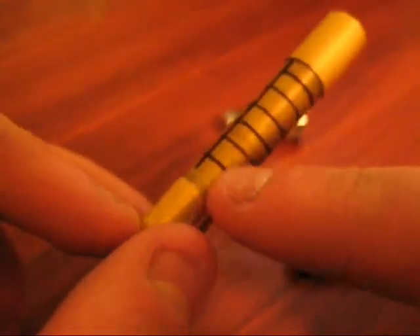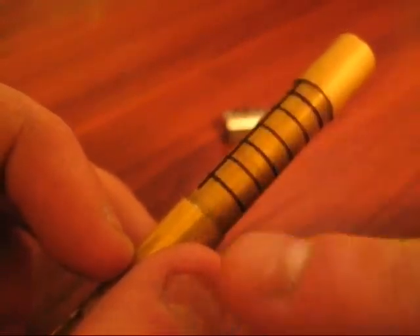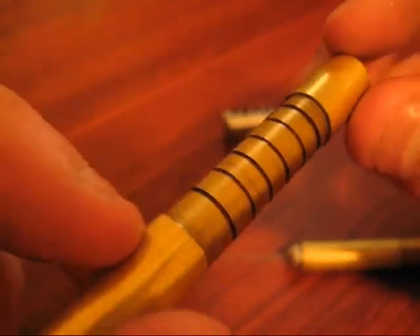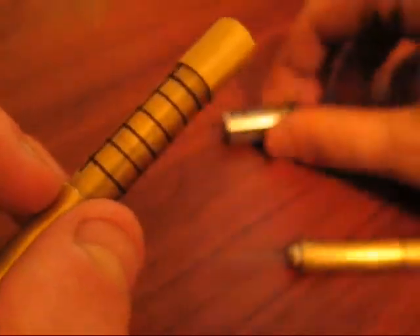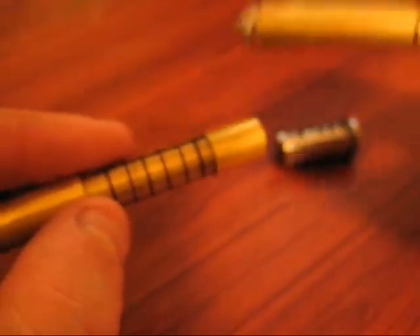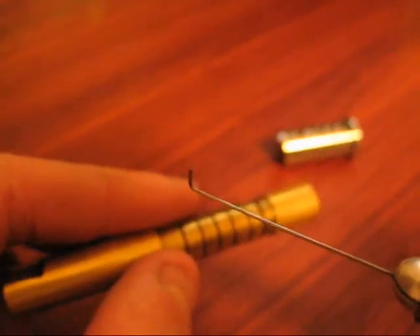The main part of this is the scale. I call this whole part the scale tube. This is the scale — it's marked out exactly, or as close to exactly as I could get it, with the spacing of the teeth on Medeco sidebars. What this tool does is you use this wire right here and you hook into the sidebar groove of the key pins.